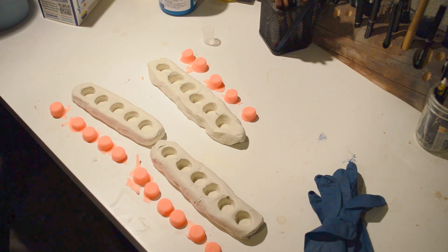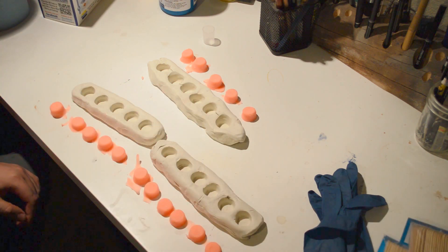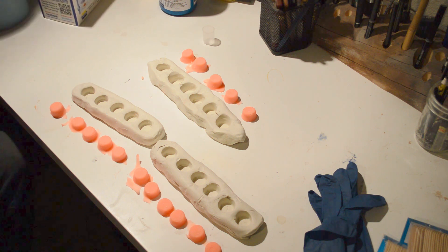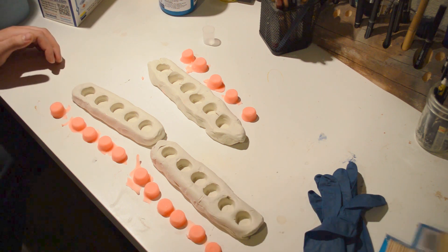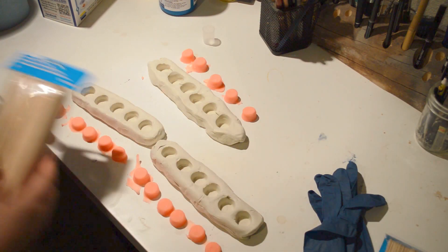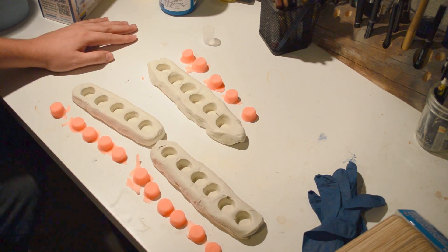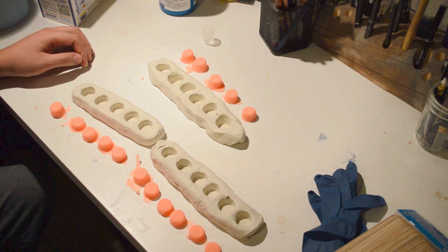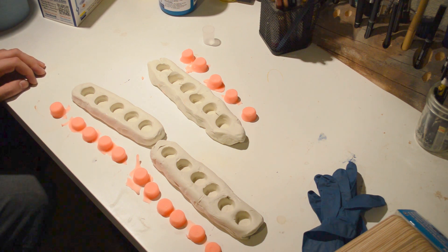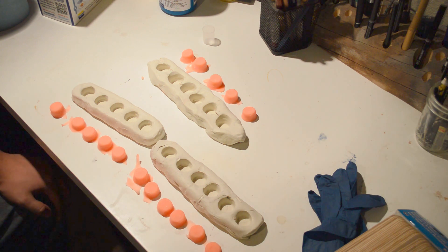Also, popsicle sticks — just buy some damn popsicle sticks. I used coffee stirrers and they just weren't doing a good job of mixing, then I went and got a plastic knife. It worked, but the main thing is you need something with a flat side so you can scrape the insides of the cups and get all the silicone really mixed up good. That does it for my small-scale test of my registration keys. I'm ready to start doing the mold of my mask. Alright guys, thank you for watching and I'll upload videos of the mask molding process soon after this one. Thank you!